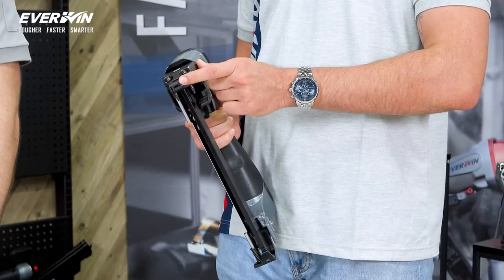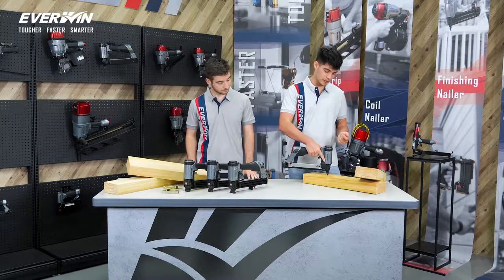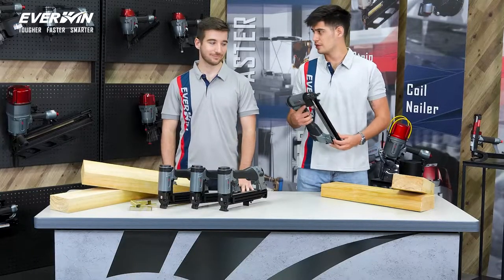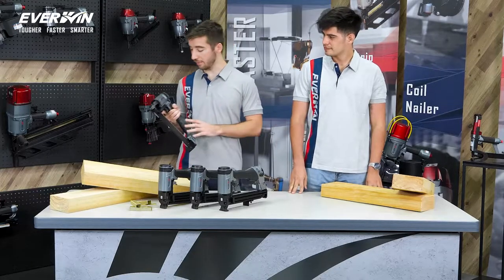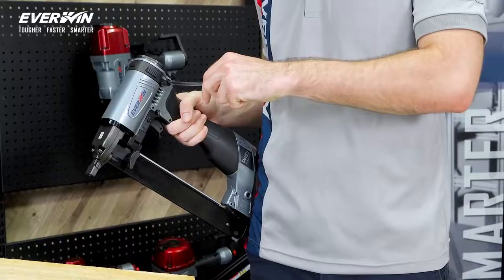Combined with its compact nose, you can have a much clearer line of sight when looking over the tool. You'll notice here how the safety element wraps around the front of the nose piece — that's good for drag firing. Exactly! And it also helps to keep in contact with the surface while pivoting a stapling direction. Now, let's cover some of the other key features of this tool. One unique feature that we have here is the power adjustment knob, which is separate from a traditional depth adjustment. And by using our screwdriver, we can adjust the power.